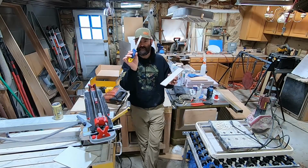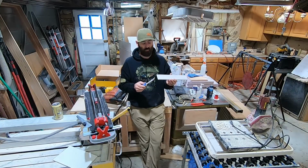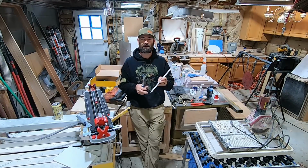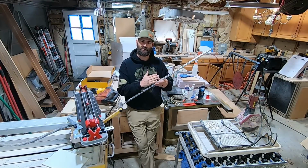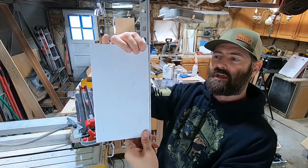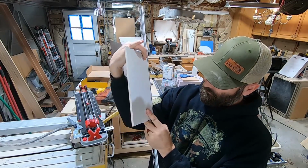No need to polish your edges with a diamond file, although you can in certain situations get a really nice edge by using a diamond file after you cut, if you have to have an exposed edge. The most common way to cover up the edge of your tile is with this aluminum channel here. That is kind of the finished edge there. Looks nice. So you don't have a caulk line or a grout line on the edge.